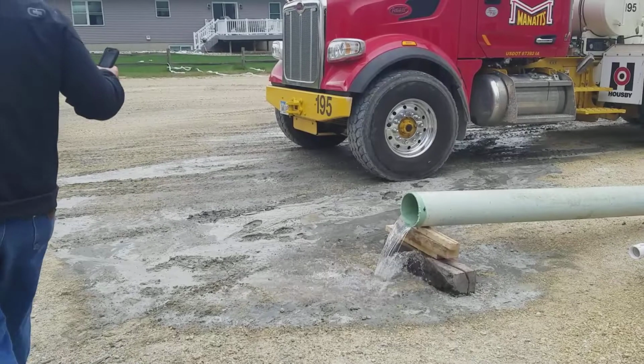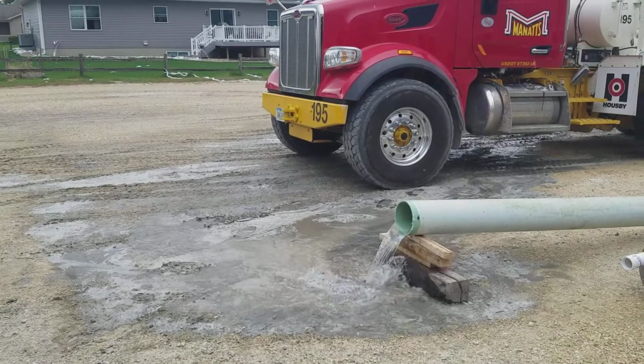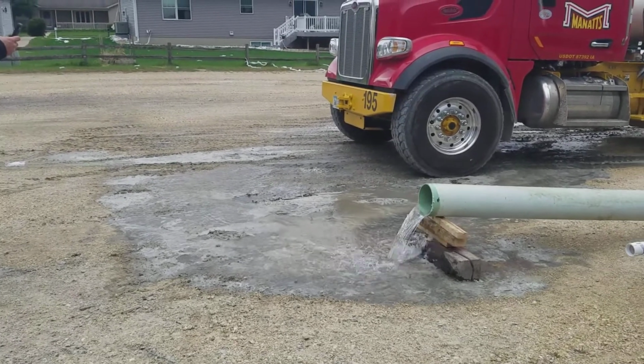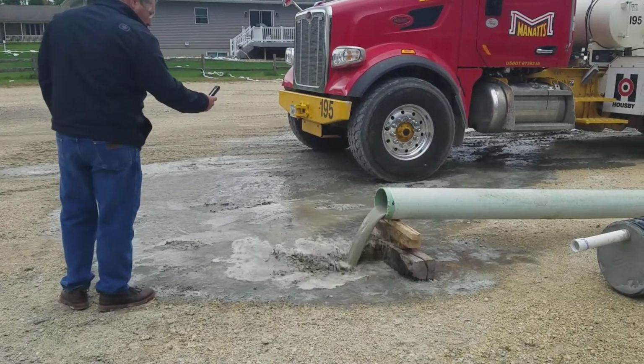The first pipe we filled was just a sewer drain pipe, so we left the end open to keep pumping pressures low. After we had the pipe filled with water, we dialed in one of our CT30D crete foamers to produce 40 PCF material. Once we had the pipe filled up, we dialed in the machine to the right density before hooking it up to the pipe.